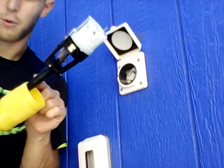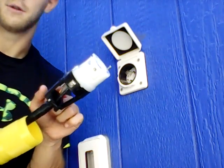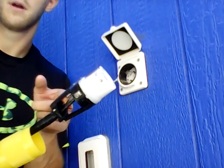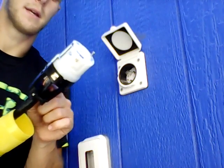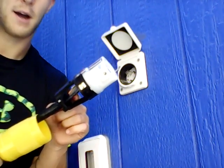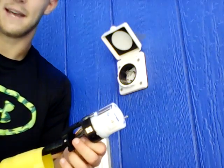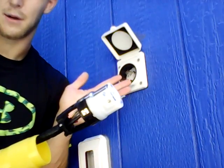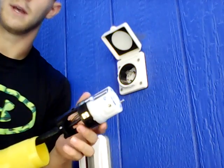This cord normally has four wires in it: there's a black hot, a red hot, a white neutral, and a bare copper ground. What I've done is I've cut the red wire, so there's no way at all that electricity can get to that wire — the only hot wire is the black. Essentially I only have 110 volts going into the house; I only have one hot line going in.